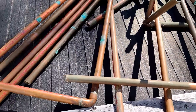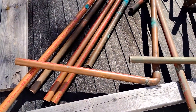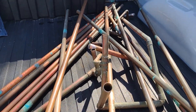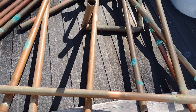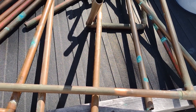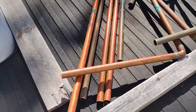I took the weekend, all the copper pipe came out, and I replaced it with CPVC. I got a journeyman plumber's license in the early 90s — CPVC is great. People go on now about this new stuff, PEX, and yeah, PEX is fine if you're in a situation where freezing is a problem. It will expand and stretch rather than burst — that's its appeal. However, in my basement it's never going to be below freezing.